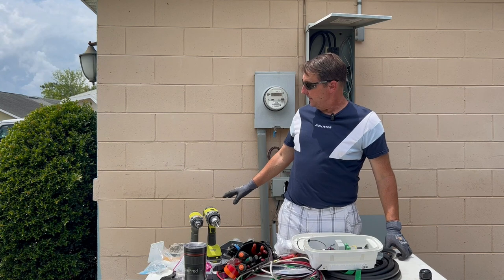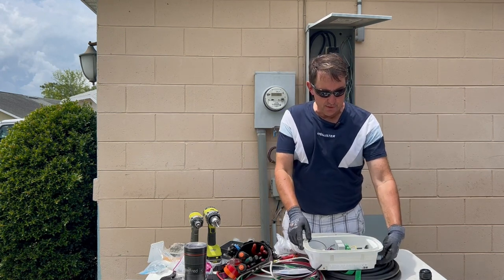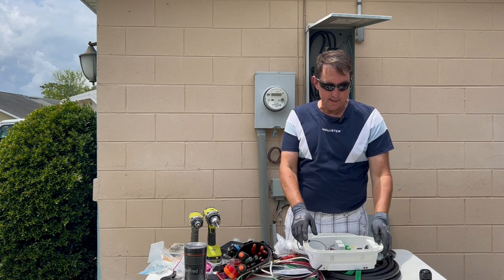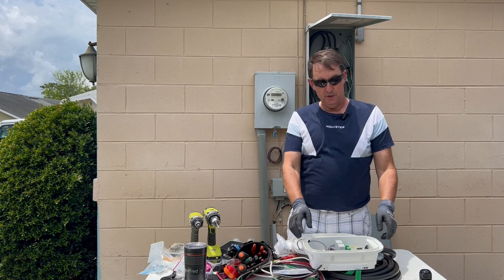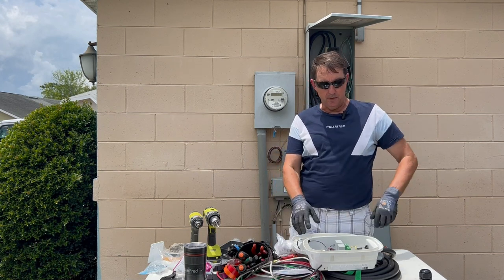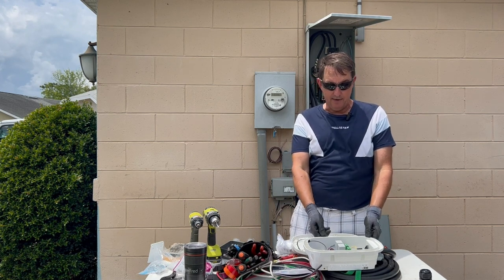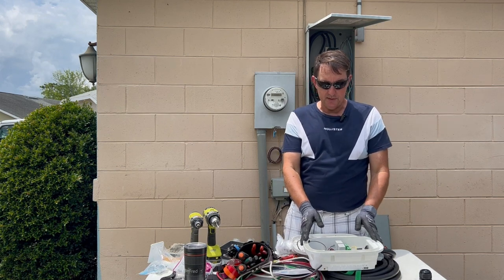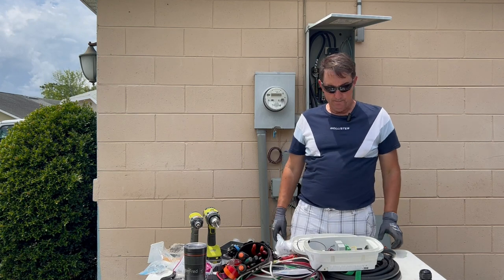At this point we're probably going to hang the mount on the wall first — that'll give me an idea of where the EV charger will go and how much flex I'll need. We've decided to put the wires in after that, put the flex in with the measured length, and leave extra wire for getting into the panel. I believe trying to put the eight screws back in while it's up on the wall would be really difficult, so I'd like to get the wires in here first, tighten them down, put the cover back on, and then hang it.